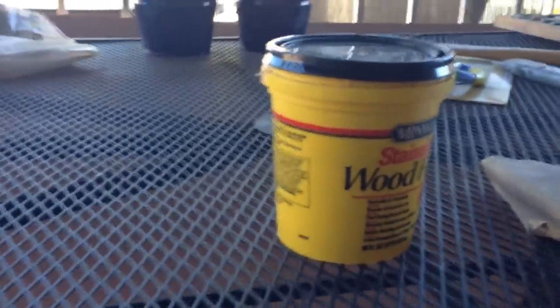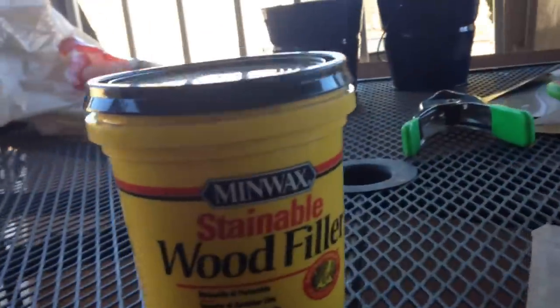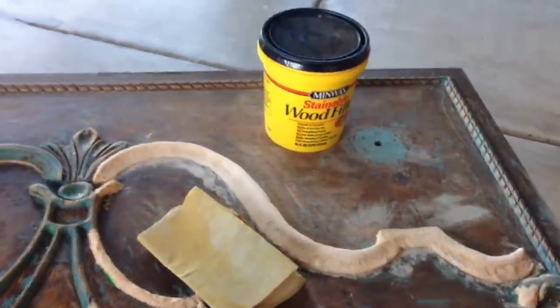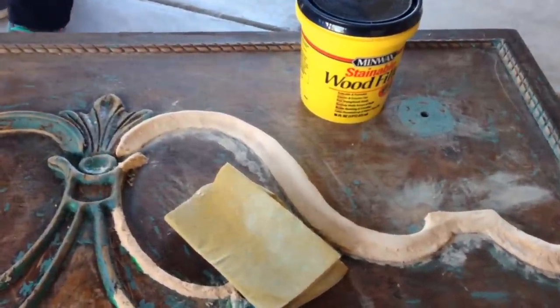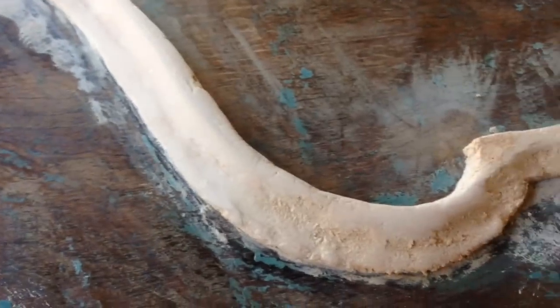This is the wood filler we're using — we just got it at Lowe's. A lesson just learned about this wood filler: it dries like cement, even harder than plaster, and it sticks really well. So if you're very liberal with it, you will sand for a very long time. If you're trying to shape it, you're going to have to carve it with a knife, which is what I did — I got out my Swiss army knife because I've had to actually cut some of it away. But it's extremely awesome stuff.